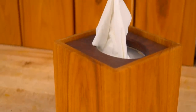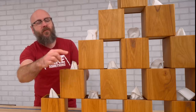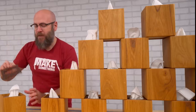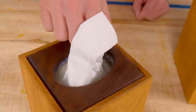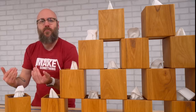I purposely have the grain running vertically instead of horizontally — that way we have long grain to long grain on the miter joints and we don't have to reinforce them. If we had the grain running horizontally, we'd have end grain and we'd have to reinforce that with splines. I chamfered the bottom so there's a shadow line along the base, and I chamfered the top piece to create a nice transition from the walnut to the hickory. It darkens the outside and creates a beautiful transition — it softens the look versus a hard edge.